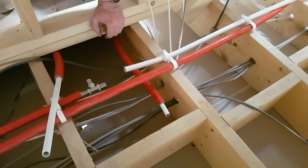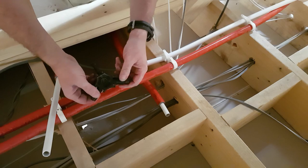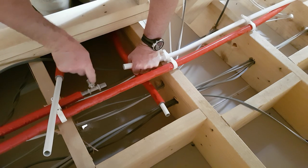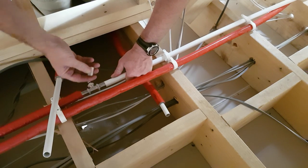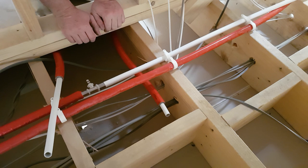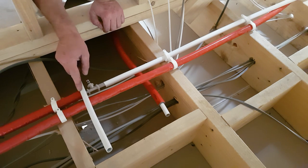Now I want to do the three-quarter, which is the 20 mil. I get my reamer tool — this is inch, three-quarter and a half, so that's 16, 20 and 25 millimetres. I use this one and prep the end of the pipe. Now I want this all the way in, and when I can see it in the locator hole, I'm done. We're all the way in to the locator hole. Now I have to change the head — that's the slow bit. What I'm going to do is clamp this on. I'll show how I figure out where to cut this pipe.